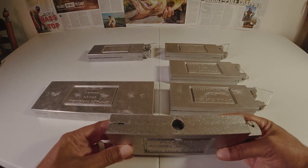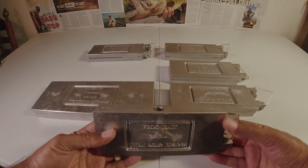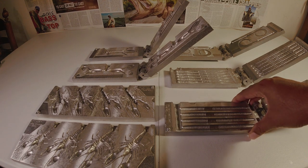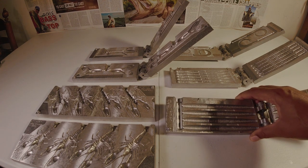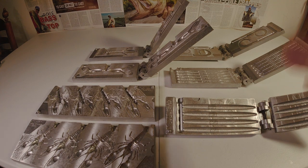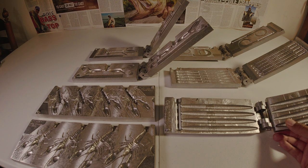You still want to clamp these molds. When you're injecting, you don't want to apply a ton of pressure or you will flash it. I won't be able to speak to longevity of these molds yet, but at least I can give you an overall first look and see what the finish of the lures comes out like and how easily these release. I'll go ahead and move these over to my bait making station and let's get to cooking.